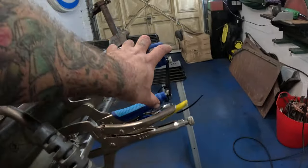And each one of these holes will get filled with weld, call that a plug weld or a rosette weld if you're feeling posh. And then once that is all spot welded in place or plug welded in place around there, I can then run a really nice big hot fat MIG weld all the way over that join, and as that penetrates through to the other side, that will also latch onto this part here.